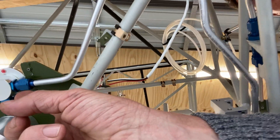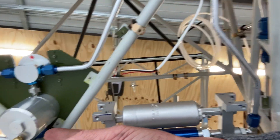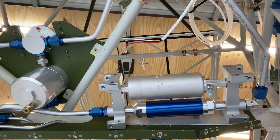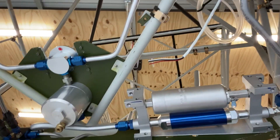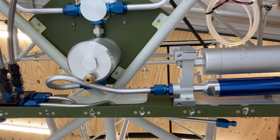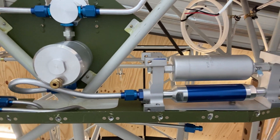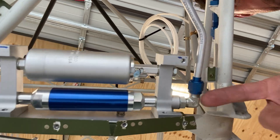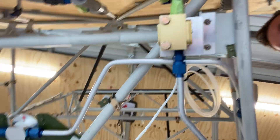Looking from a low angle: the left and right fuel lines go into the fuel selector, then exit aft into the gascolator. You can see the quick drain on the bottom, accessible through the tunnel — I've put a hole there so I can drain the fuel. One compromise I had to make was the way that pipe is bent, due to limited room at the junction of the steel frame members. The fuel line then comes into the electric pump, exits out, runs into the fuel flow transducer, and then into the firewall — which I've disconnected because I removed the firewall.